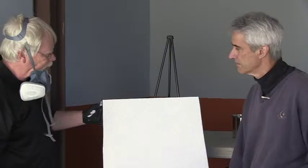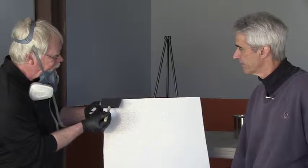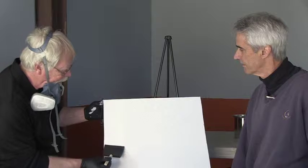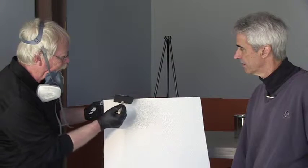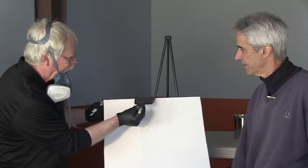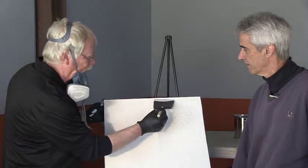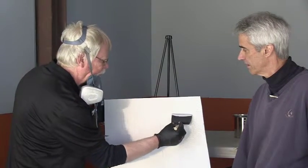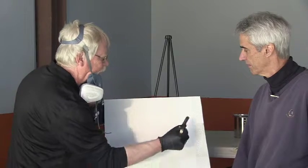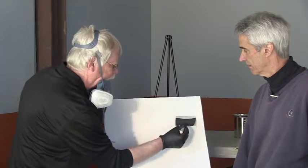I use a dry brush when we're dealing with these. I use a foam dry brush, 4-inch, when we're dealing with these linear urethanes, the two-part. And I start at the rail and tip down with a little pressure down to the waterline. I see you flipping the foam brush around a little bit. Is there a reason for that? Well, what we're trying to do is not add paint to the job with this tool. We're just trying to knock off those bubbles. When this brush gets full of paint, I actually toss it and go to a brand new brush. Because once again, we're not adding paint to the job with this tool.